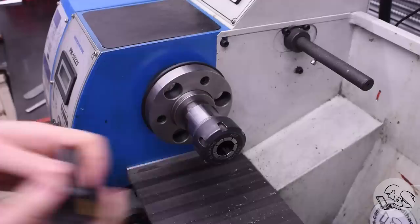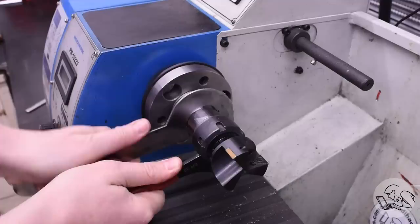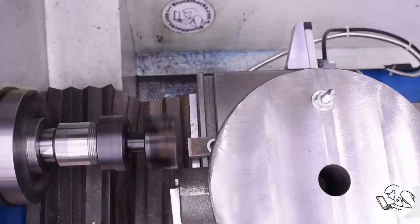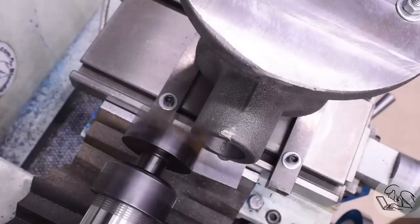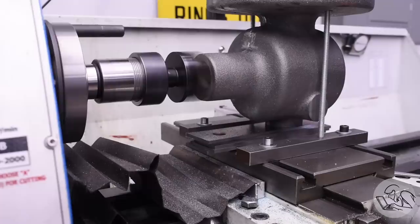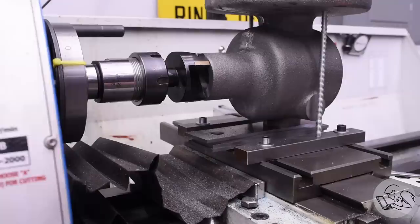Here's a way that might work for that: I'm going to put my tri-fly face mill in the spindle. This is a Schrum Solutions tool — basically a three-insert face mill. The reason I think this is going to work is because the cutter is a larger diameter than the nose on that casting. What that means is I can do a single-axis milling operation — I don't have to have some kind of vertical milling contraption for my lathe. I can simply move back and forth with the cross slide and face the entire surface. The one catch is that I don't have enough travel on my cross slide to get the work completely clear of the cutter on both sides. However, if the cutter is a larger diameter than the work, you can cheat by stopping when the work is centered on the cutter — you can hear when you're in that eye of the storm because you can hear it stop cutting. Then just pull away from the work so you don't drag half the inserts across the back half of it and mark up the surface.